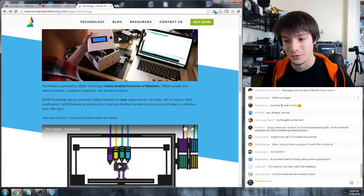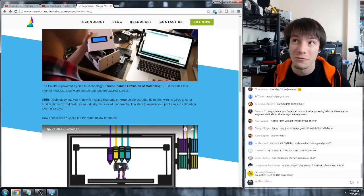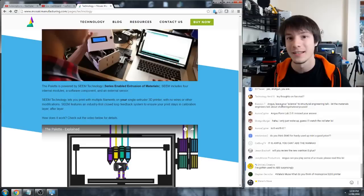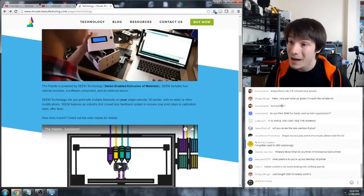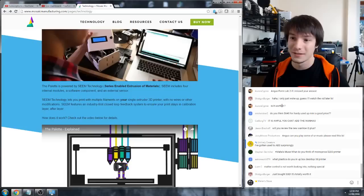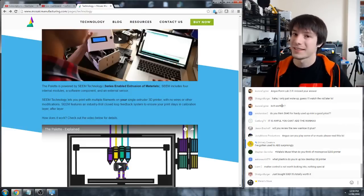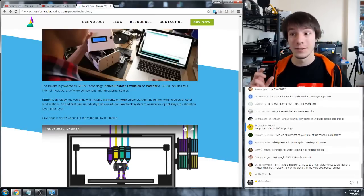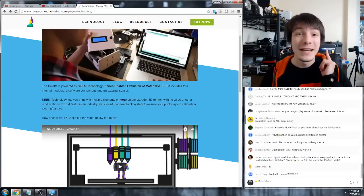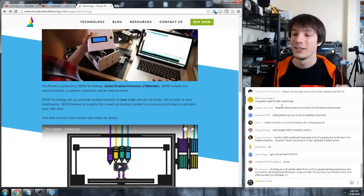Aurora Cypher is asking about the Formlabs 2 - is it worth it? I don't own an SLA printer and have only ever used one once - the Asiga Pico Plus, a nice DLP system. The Formlabs 2 is amazing from everything I've heard - extremely high quality, high resolution, and the parts look amazing. But resin systems are messy, the vats are consumables that wear out, and it's much more expensive to run than FDM. If you're making custom Warhammer figures or small detailed prints, those machines would kill it - you could print custom figures cheaper than you could buy them.